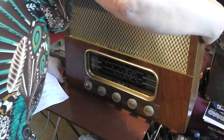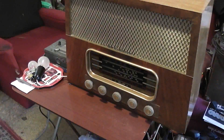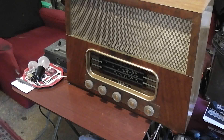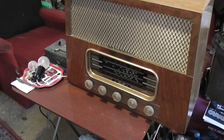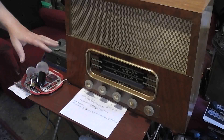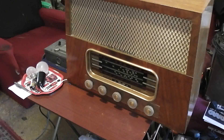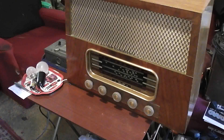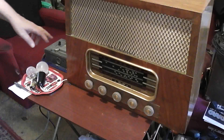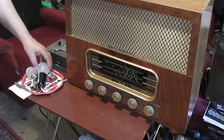It balances a little bit on the table here, so we do have to be a bit careful. As with my earlier ones, I put the 15-watt bulb in — the highest resistance one — connected it up, left it turned on for a few minutes. On the voltmeter it started showing 30 volts, then gradually built up to 75. Then I swapped to the 25-watt bulb, which showed about 120 volts. Then I went to the 40-watt bulb and it went up to about 145 volts.